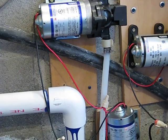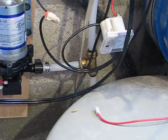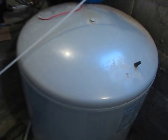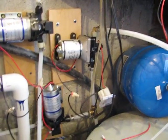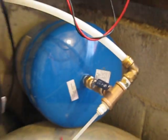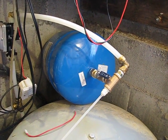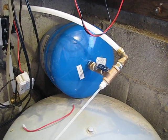Together, they'll pull about 14 amps when running in series like that. Then that T's right there — one line goes over to this storage tank. It goes to that storage tank and from there runs out to my water softener and into my house. This third pump I use to boost my pressure even more, and it comes into this smaller storage tank which I pressurize up to anywhere between 50 and 90 PSI.